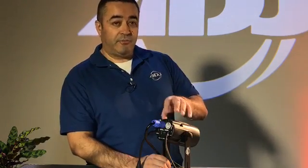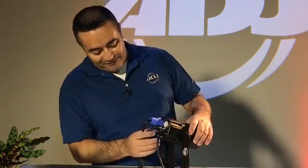those different modes or dimming modes will give you either a delay when it turns on and a delay when it turns off. So even if you don't have it plugged into a DMX controller, it will still act as if it's a tungsten lamp just by selecting your proper dimming mode, and that will give you a certain delay when it turns off and on and off.